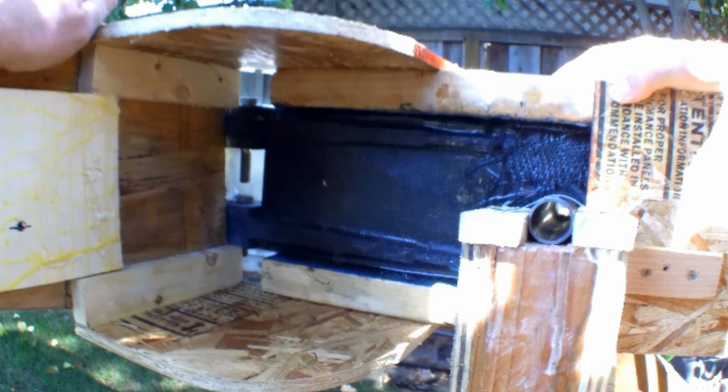The steel pivot tube that you see is a component that I'm testing for the final design of the wing attachment methodology. It passes through a 1/4-inch wall thickness carbon fiber bushing, and that whole arrangement is something I'm considering using for the final wing attachment methodology. The fittings that I'm testing that attach the wing to the test rig are a backup design. I know that they're going to be plenty strong enough, but they're a little bit heavy. So I'm actually testing a backup design for the wing attachment, and I'm also testing a potential final design of a wing attachment method that uses that steel tube through a bushing. So I'm getting two jobs done with one test.